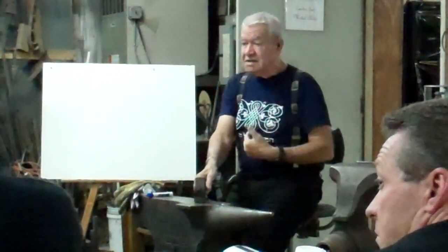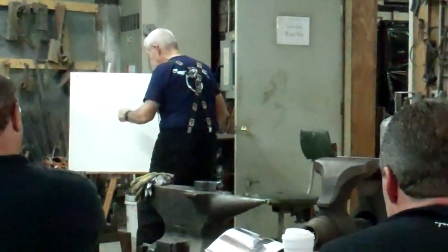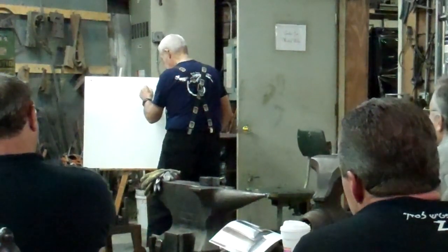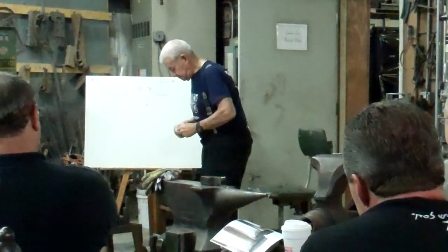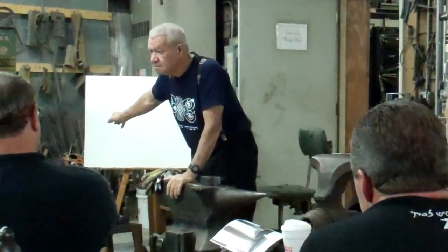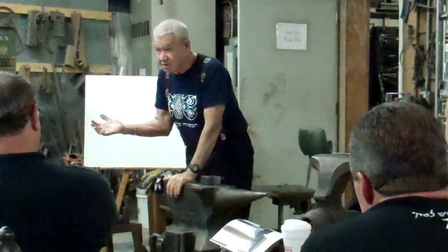Now, there is something very interesting. We get work. We move the metal by hitting the metal with the hammer. Newton found 300 years ago that the work we get is equal to the mass of the hammer multiplied by the velocity squared, divided by two. That means the velocity squared is very important. The faster you can go with the hammer, you get work squared. If you can move a heavier hammer, you get much more work. Okay? Is this understood?